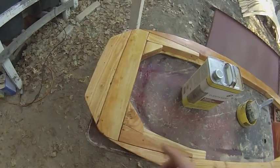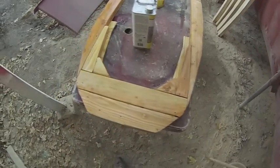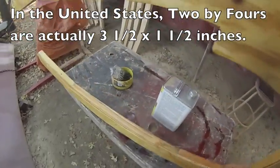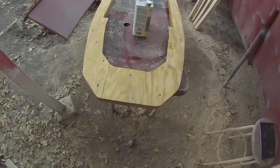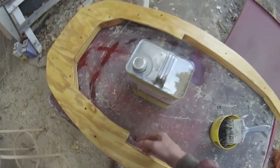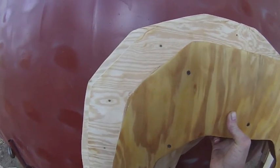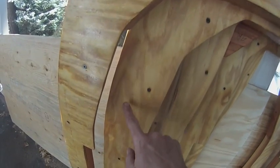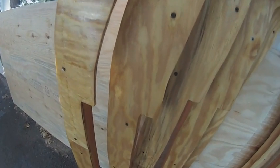Putting more linseed oil on the wood. This is what the construction is like of a typical piece — these are the Douglas fir 2x4s, and then on the other side, that's how the plywood is attached. These pieces here are where a 2x4 is going to get inserted and I'll screw it in when it's time for that. Here's a comparison of what the oiled wood looks like compared to the raw. I had some drips running down this piece and I just let them drip because nothing happens — it just gets absorbed somehow. It didn't reach the bottom and you can't even see it.